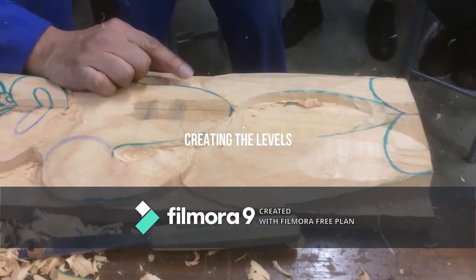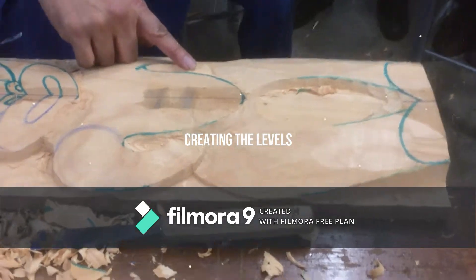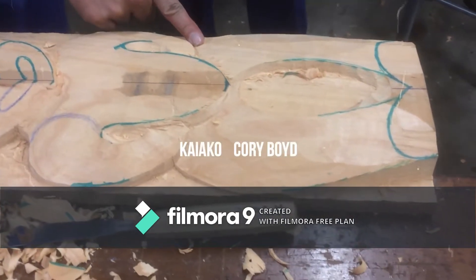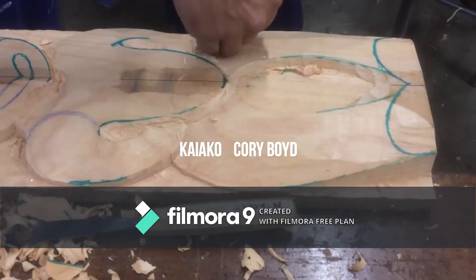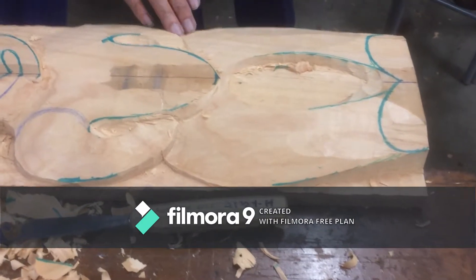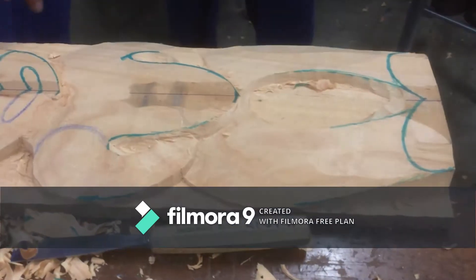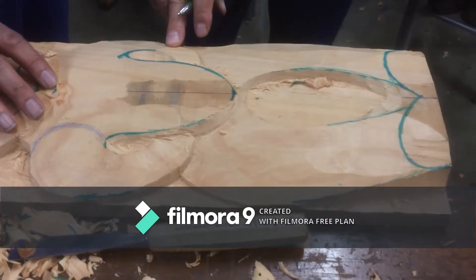So with this cut, you don't want to cut too deep for this one, because if you cut deep with this cut here for your arm, you've got to cut deeper for this one. And that means this leg ends up going into the base. We want to try and avoid that, because the top of the leg is going to be below that.